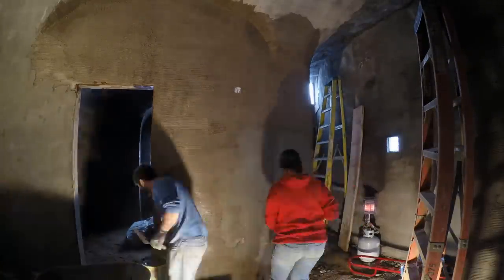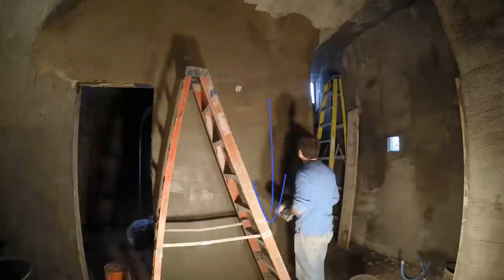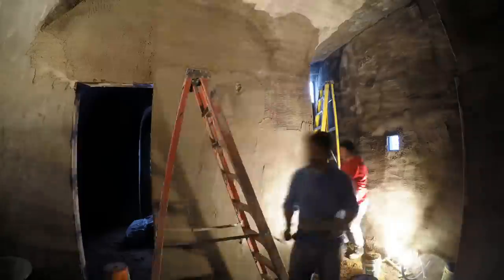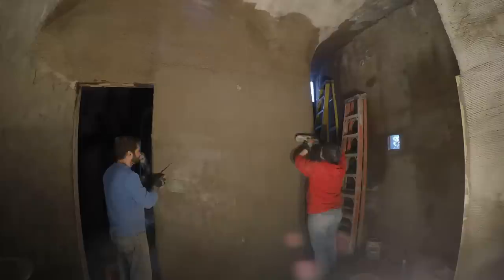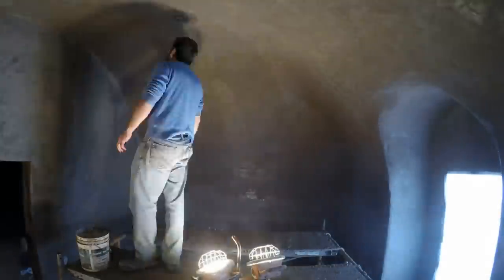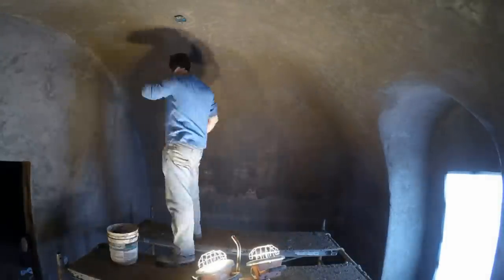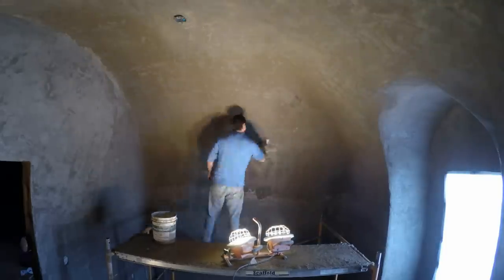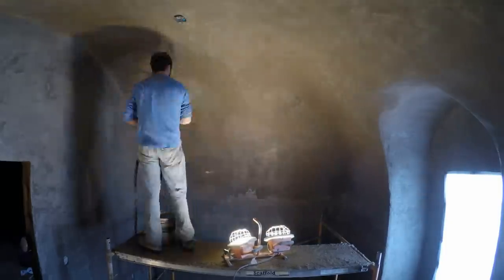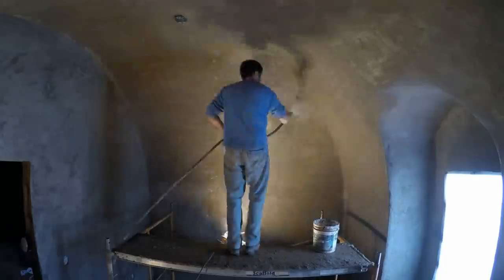For this section of wall, I overwet the wall before getting going with the stucco and that river of water was still flowing down in that one section. So we had to slow down and then eventually I could cover it. It was pretty fun to spray the walls and get the mist going, but the practical purpose was to try to soften up the previous day's stucco so I could rubber float it. Again we saw weird texture patching and sandy patches, so I decided to try to wash that off — and that only made things worse.